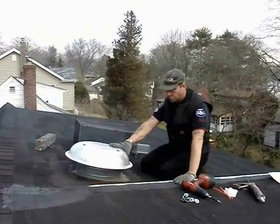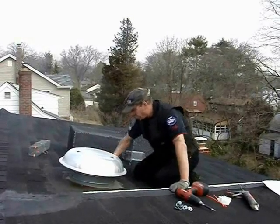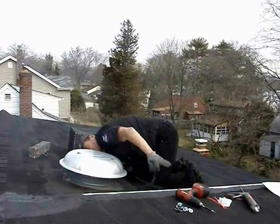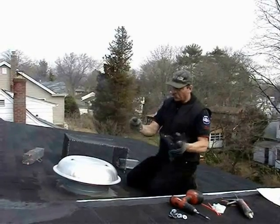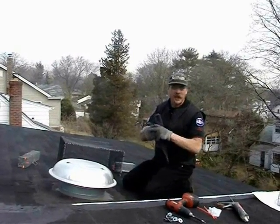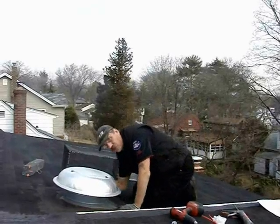Here's our ventilator cover. Before we do anything with this — I had already taken this lid off — I want to make sure that you understand that this interior screening trash must come out. You don't want this in the blades anywhere where it could get jammed up. This was already jammed into the blades. The squirrel just pushed this down in there, so we want to make sure that this garbage is not in there anymore, and that the blades rotate freely.